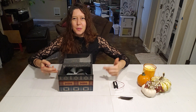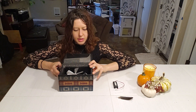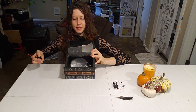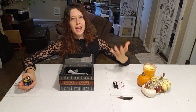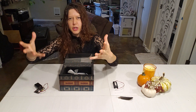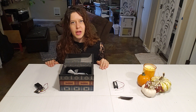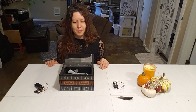And then the microbit in the box gets the signal. It shows a little icon — oh, it's hitting the box! Okay, let's not have that happen. But it shows an icon, which is really handy so that you know that it got the signal. And then it triggers the motor through what is called a MOSFET transistor. The motor uses a lot of electricity, so we need a special type of transistor that can handle that current. I found that out the hard way because I blew up a couple of parts.